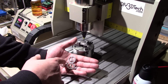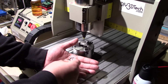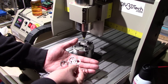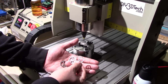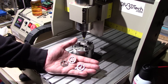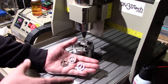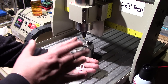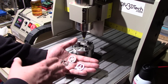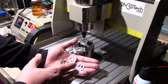I got two passes where after it cut out, it ran the bit down and really cleaned up these pieces. I think they probably still need just a touch of filing, but they are better than the partial one that came out before. I'm pretty happy with the way these came out — they're kind of cool. I really like this idea of messing around with coin art. I'd still like to get back to a 1.75 because I can get better resolution. As you saw at the onset with the tool pathing geometry, it's pretty tight with the 2.4, but it definitely wore a lot better than the 1.75.